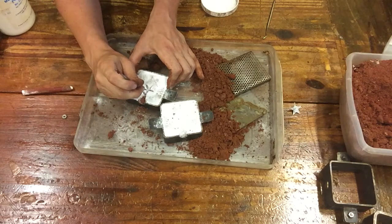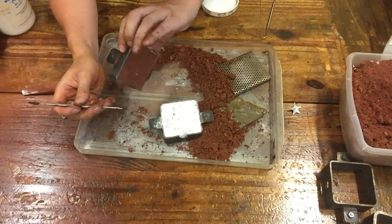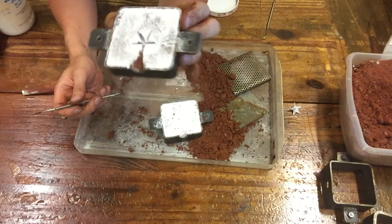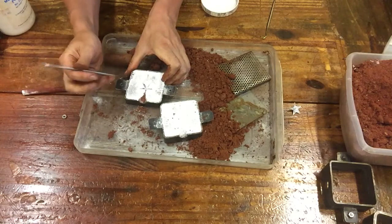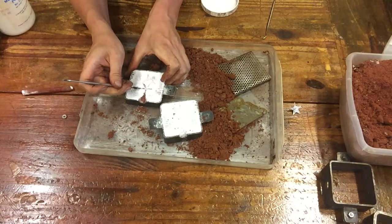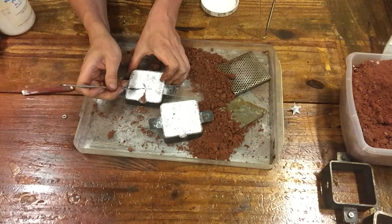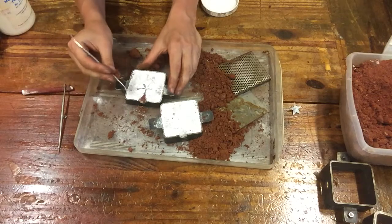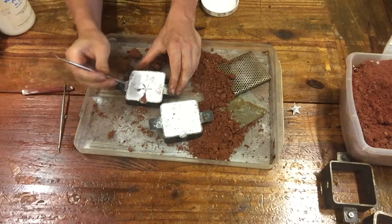So then we're going to talk about venting. And the thing about all these little points that you can see in the mold is they can collect air and trap them. So oftentimes what you'll do is you'll take a tool and you'll just add a little blind vent, right? You'll cut a trough so that your material can go somewhere, right? So I'm going to switch to a different tool and just cut my trough.